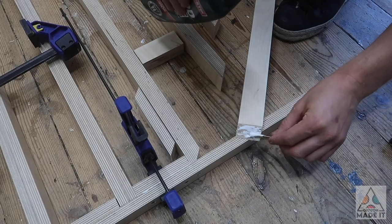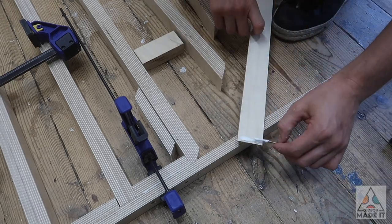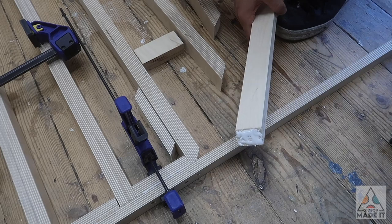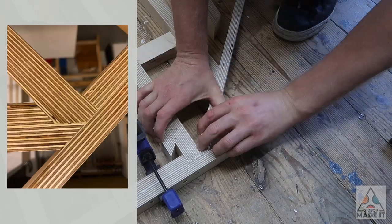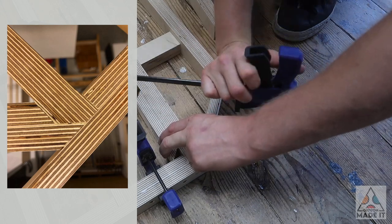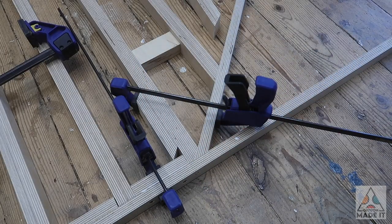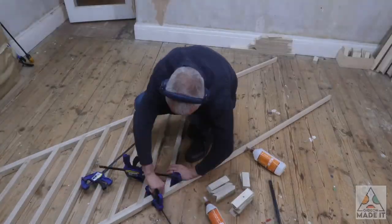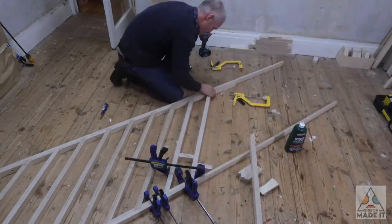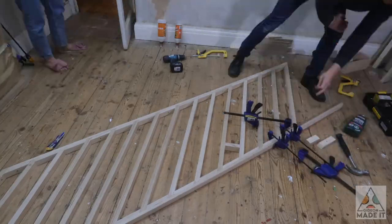The spindle you're seeing here is the one that received the handrail and had a little angle cut to it. I knew that junction of the spindle, top rail, and handrail would be important to get right visually, so I took my time to get the angles and clamps as tight as I could. Once that joint was made and the first full-length spindle was in, it set the final angle of the handrail. The rest of the build was just a matter of adding the remaining spindles by gluing and clamping them into place along with the spacers.